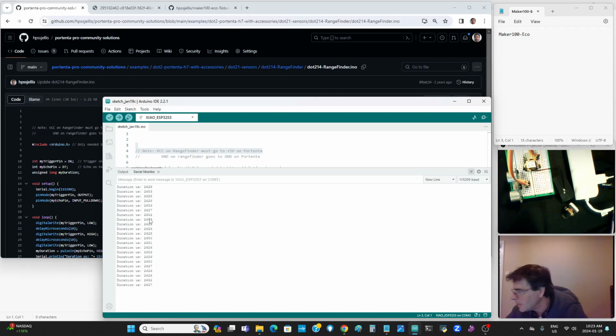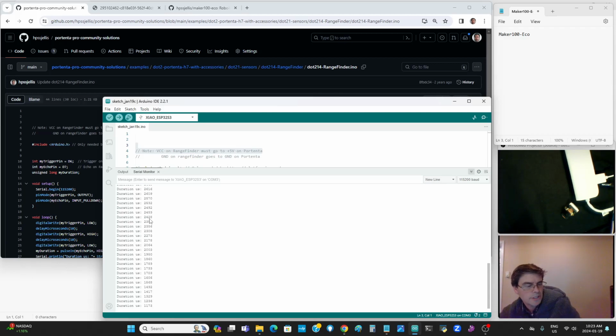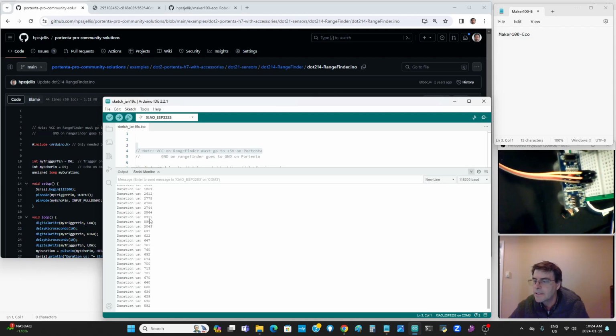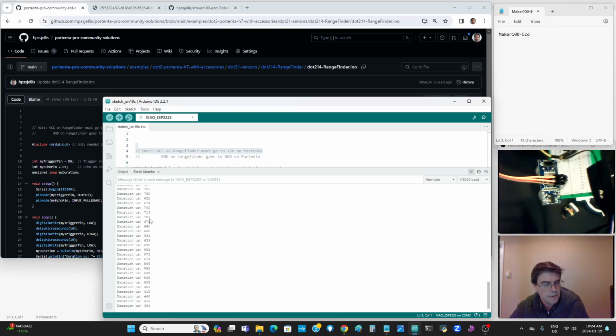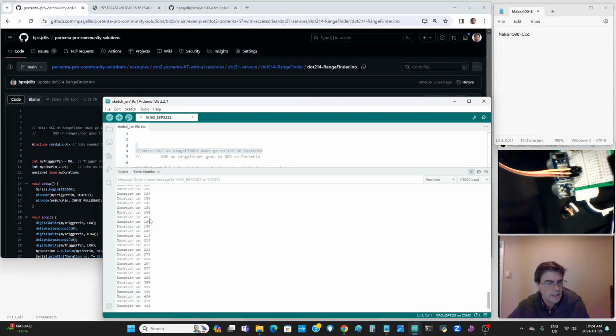We have a pole about a foot away from the rangefinder. So watch what happens as I move closer to the post. The numbers go down. Totally makes sense. By the way, it's good till about 10 centimeters. Watch what happens as I get closer to the table. It should crop out. Yeah, okay, so much for my information. You see, right as I get within touching range, the numbers go a little weird, but then as I pull farther away, it gets more linear.